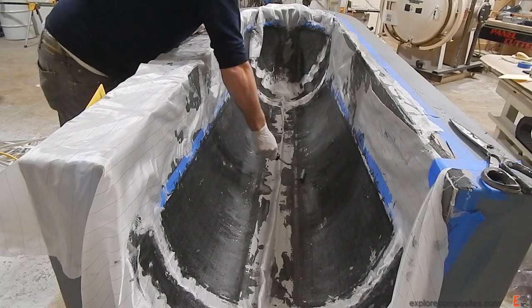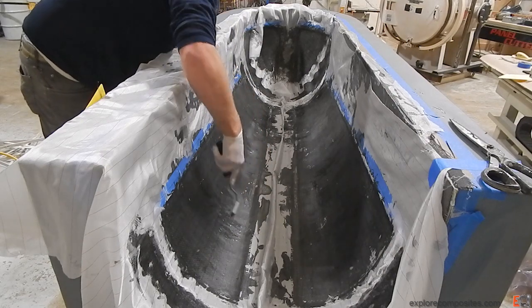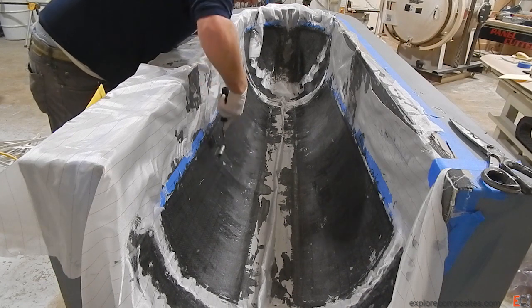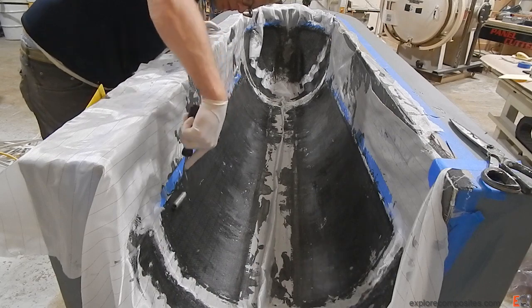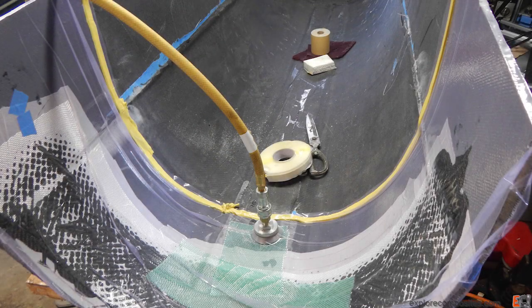Adding the extra laminate to the single-skin zone as a second step — that was something I did after talking with the paint shop and being concerned that they wouldn't have enough stiffness to block out a nice finished paint job. I wish I had thought of that earlier and been able to do it in the original layup — I would have put that extra ply of carbon in between the two main skins. That would have been a lot tidier and lighter and less of a mess, and I wouldn't have had to go back and repair some of the burn-throughs I made on the inside. 200 grams of carbon is not that much when you're going at it with a sander or grinder, especially when you're in a hurry.